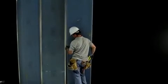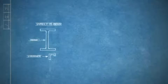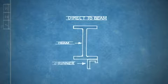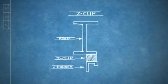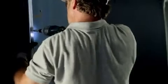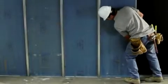Finishing a shaft wall that's UL classified for fire, sound, and smoke resistance starts with knowing the right systems and designs. USG will show you three different methods of maintaining a two-hour rated assembly using various head-of-wall designs: direct-to-beam, using a plate extension, and using Z-Clips in conjunction with UL Design U415 System B. This proprietary head-of-wall system offers drywall installers a complete solution that meets building code requirements for fire, sound, and smoke in a cost-effective way. Not only does this add to the services drywall contractors can offer, it also streamlines sequencing by enabling them to deliver a finished system.